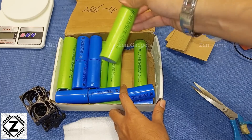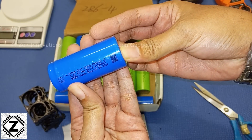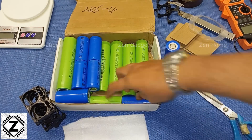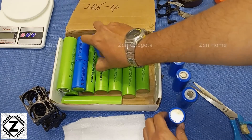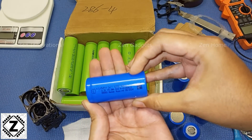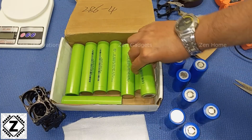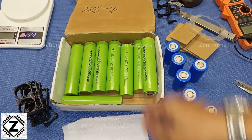The broken holders have also scratched up a cell a little bit. These are the HX brand 6Ah lithium ferrophosphate — LiFePO4 — cells and these are supposed to be 3C, the EV grade. I also have 8 pieces of 15Ah cells. Always check your cells for dents and damages; in the past I've had careless sellers ship them so badly that the cells were totally dented and unusable.